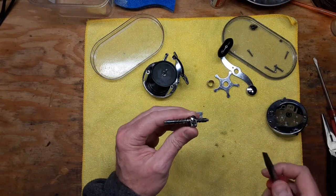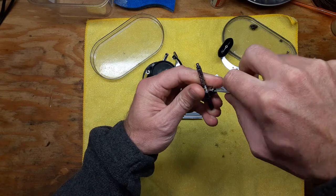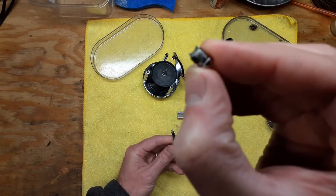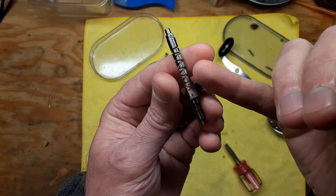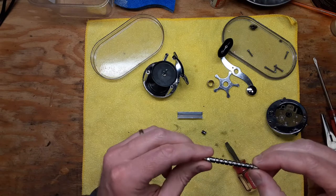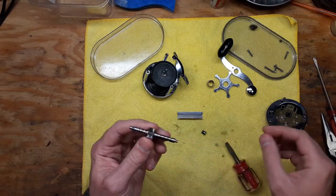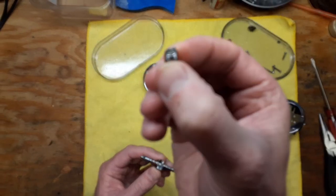What you're going to have to do here is take a little stubby screwdriver and loosen up that screw. Under the screw is where the pawl is. The pawl is basically just a fork — it's got these two little teeth and it digs into the slots in the worm gear. You want to clean up all these pieces and parts. Take a toothbrush and some multipurpose lube and clean it out really well. Then you're going to insert it back in — make sure your pawl is clean. If the teeth on this are chewed up too much, it might need to be replaced, so you just need to inspect it and check the condition.